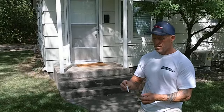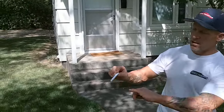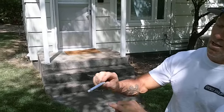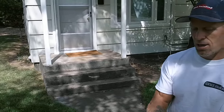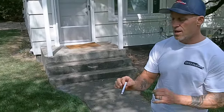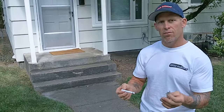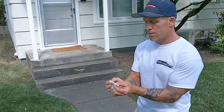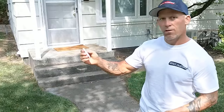On these lead test kits the swab has an A and a B. We're going to put our thumbs on both points A and B and crush them. Inside there are little glass vials — you crush them with your thumbs and the chemicals mix together, which makes it ready to test for lead. So I'm going to squeeze down and pop both of those, and now both of them are broken.